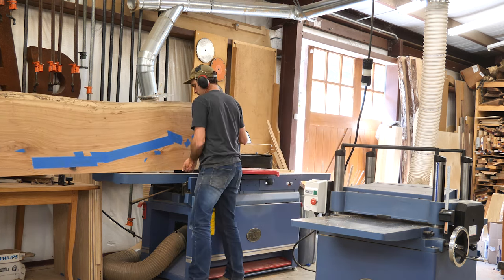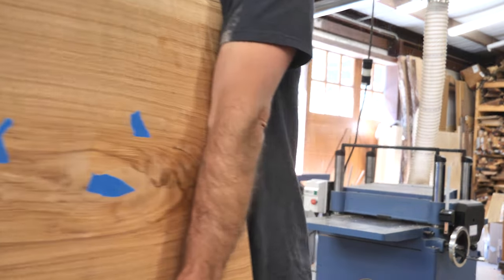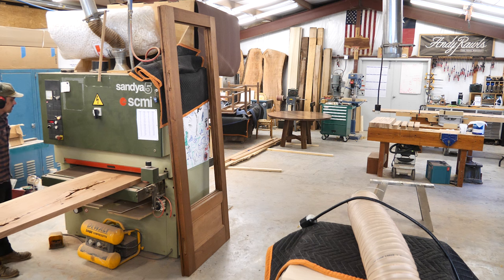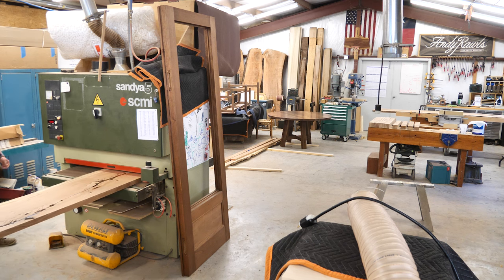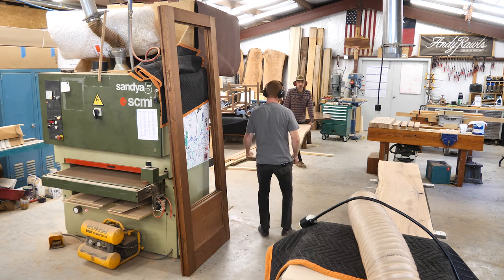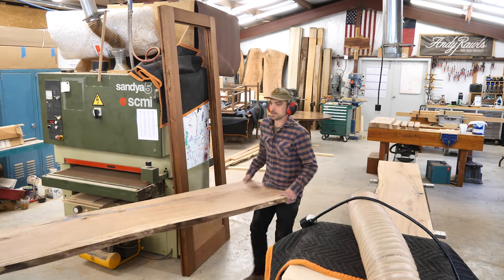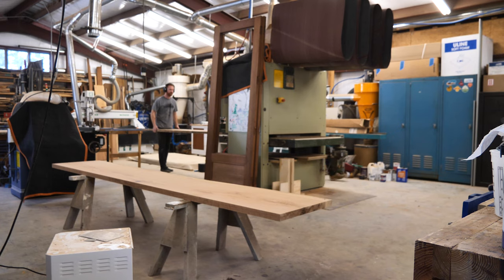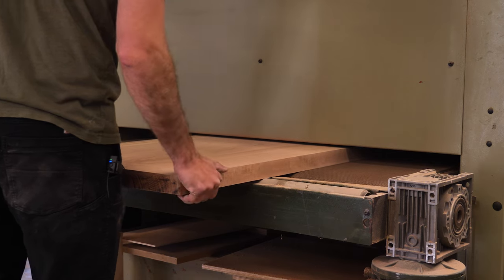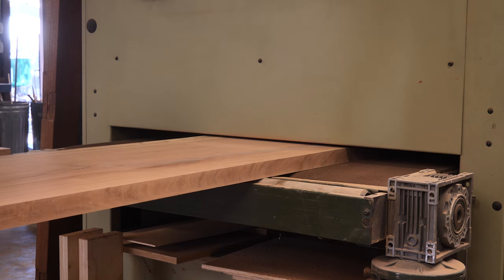I also have to add that it was a pretty good idea for Oliver to put a foot stop in this jointer — I just love that feature, pretty dang cool. Before we move forward with the edge joining, we're going to run these through the wide belt with 80-grit sandpaper, just to clean off any excess epoxy that's sitting proud and get them nice and smooth and flattened back out. We had one good face that we used on the jointer but we want to get the other face cleaned up. Once we get these cleaned up, we're going to move to edge joining them with the hand plane. We're also going to face some challenges on how we're going to glue this up since it's a live edge — you can't really get clamps on the edges. This is really soft sapwood, so it would just dent and damage those edges.